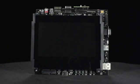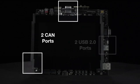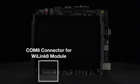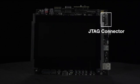For connectivity, the AM437X EVM features a gigabit Ethernet port, a UART, two CAN ports, two USB ports, audio input and output, and a connector for mounting the WiLink 8 Wi-Fi Bluetooth solution from TI. You'll also find user-defined buttons and LEDs. When you're ready for development, we've also included JTAG connectivity for debugging.